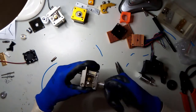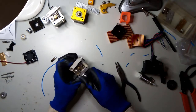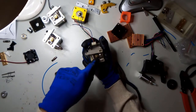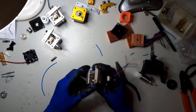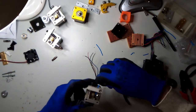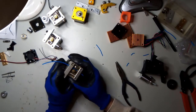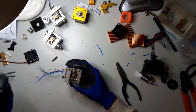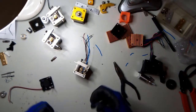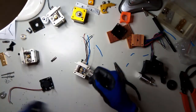I figured: just screw this nose from the hot end right up to this pocket here, very close, and then there would be no more bending. Eventually I made this - I got a 6mm thread, drilled the hole through it, and at the top I made it a bit of a funnel so you could easily stick this through. There was no more bending of the material - it would go straight through. That worked.